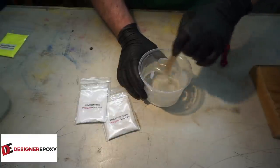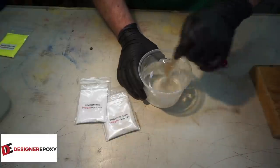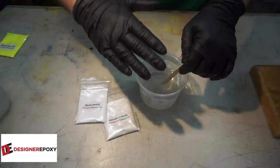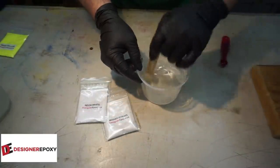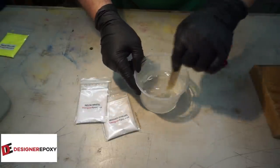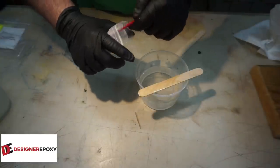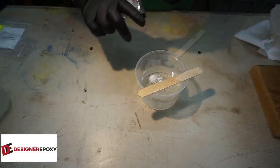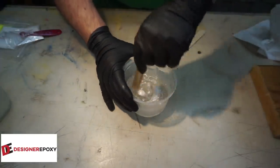I want you guys to be able to see, so I'm going to put a little bit of the granulated soapstone in the inlay areas and then pour the epoxy over top of it, just building it out in layers. Theoretically the soapstone is heavier than the epoxy so it should sink to the bottom and fill in any gaps. I'm going to put two quarter-teaspoon spoons of pigment in there first. I want it to be pretty much a solid color — not translucent at all.